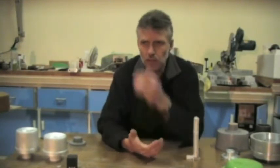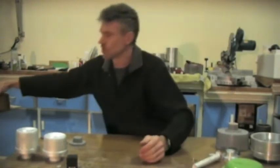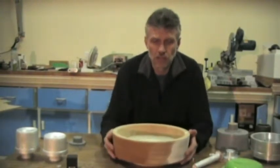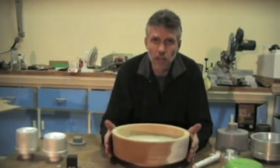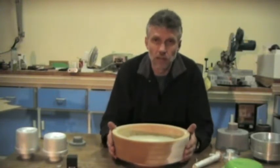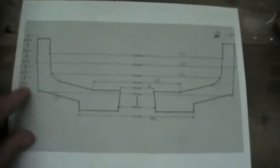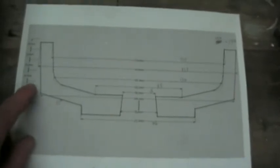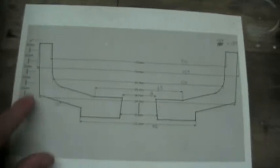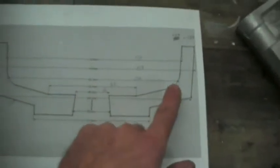For my patterns I like to use MDF because it's usually flat, so working out thicknesses is fairly easy. It's consistent in its weight, so if I were to make this and it weighs 2 kilos, I just multiply the 2 kilos by 3.5 and that will give us the final weight. This is the design down this side — the thicknesses of the MDF board: 16mm, 16mm, 16mm, 16mm, 16mm, 12mm — and here I have all my diameters.